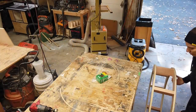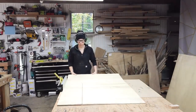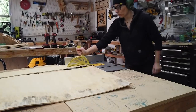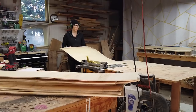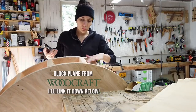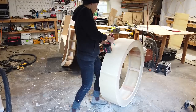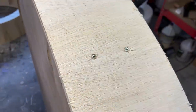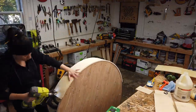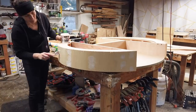What I just created with the plywood and 2x4s looks pretty ugly so it needs to be covered up. This is going to be done in stages and the top and bottom sections will get different treatments, but the base layer on both parts will be pretty much the same — this is bendable plywood. After ripping the pieces slightly oversized I knocked down all the high spots on the 2x4 supports with a block plane and glued the bendable plywood to the frames. I used brads to hold the shape as the glue dries and also added screws into the 2x4 supports. The top portion was done similarly except I added a second layer of bendable plywood to make it a bit more solid. Then I filled all the holes and tried to make the surface as smooth as possible for the veneer I'll add later.